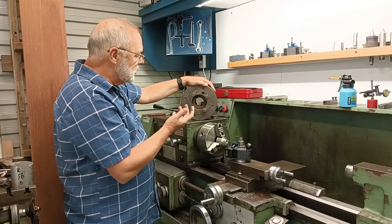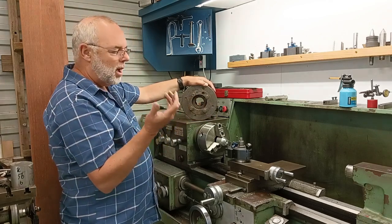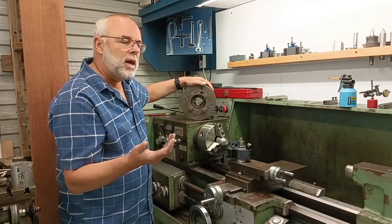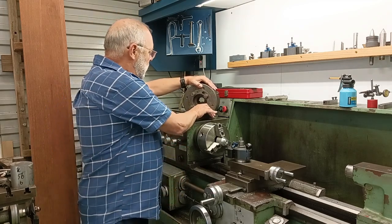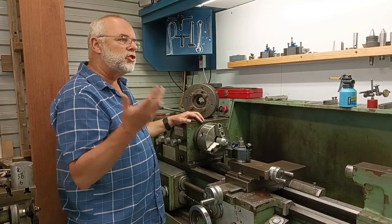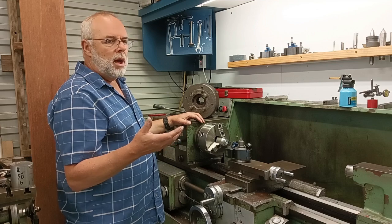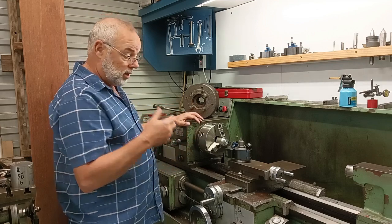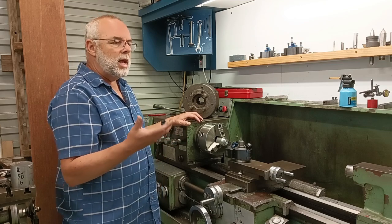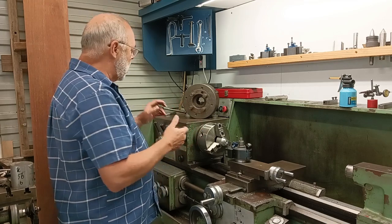The reason for that, I believe, is that the cam lock system was probably still under patent at the time, so they would have had to pay extra for it. The DIN spindle is standard, but the cam lock would have required a patent fee. ZMM, trying to keep costs down, weren't going to do that. We had similar problems in this country — lathes made here for the TAFE and college market had bolt-on chucks instead. It was only later, when the cam lock patent expired, that we actually saw it incorporated in lathes built here. So that's the machine: it's three-phase and it's a clutch-operated machine.